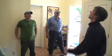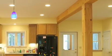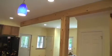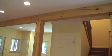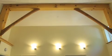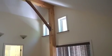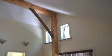So it looks like a timber frame structure. Is this structural or just aesthetic? We needed a structural ridge for the panels. We could have used engineered lumber and wrapped it in sheetrock, but we wanted to give the place a little bit of pizzazz because it's not a big house. It's not a complete timber frame — just a vertical spine here and up at the ridge, which supports the panels.